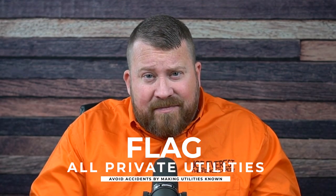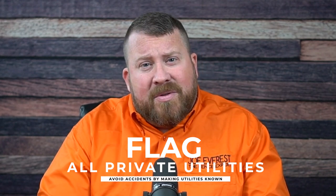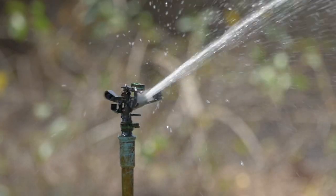How is a private utility defined? Typically, it's any utility that you use in or around your house that doesn't have a meter associated with it. The number one private utility we find all the time in backyards is irrigation, mainly sprinkler heads. We also see private electric that's run to outbuildings — electric that runs directly from your house to an outbuilding where the outbuilding doesn't have a meter directly attached to it. We also see it with wells: if you have well water to the house, the private utilities would be any power or water going from that well to the house. We also see it around pools — all the pool utilities, the water and electric there, are not going to be marked.